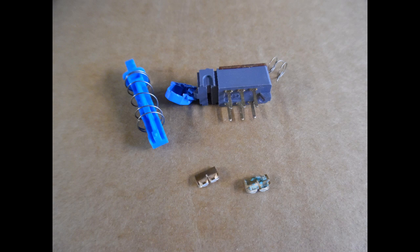I'd recommend taking some photographs before disassembly to know how it goes back together. You may need to try a couple of times to get the switching mechanism correct — if the spring isn't aligned correctly, it will operate but not latch. This amplifier's switch also has a secondary spring used to push the plunger back out when it disengages, which is under quite a bit of tension.